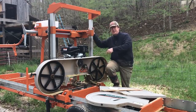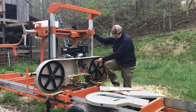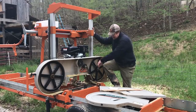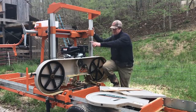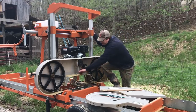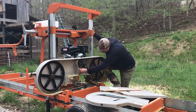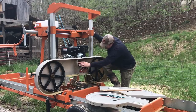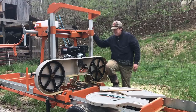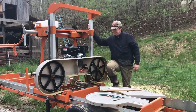In the manual, they suggest, well, if you don't want to just turn and see it lined up, use the string test. Turn it manually and have a piece of string that gets underneath your belt so it pinches. And from like the 9 o'clock to 3 o'clock position, you can get it pinched in there and you can see if it's true. Well, that would work great if it wasn't for the fact that these plastic covers have this divider here. String is not going to pass through. I searched this to see, okay, is there a pass through? Is there a notch out? Even considered cutting a notch. I thought, well, I don't want to destroy the integrity of that wall. It's there for a reason. So that's where the manual hasn't caught up with their latest accessories.